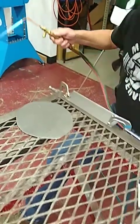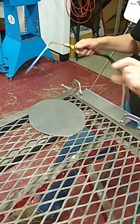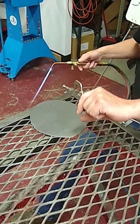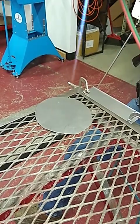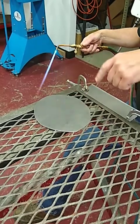So we'll come down — that inner cone about an eighth of an inch consistently off the surface of the material. If you get it too close, that's called impingement and you'll get popping. If it's up too high, all you're going to do is heat the surrounding material. You're making soup.